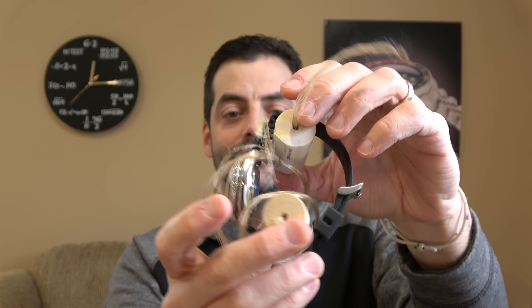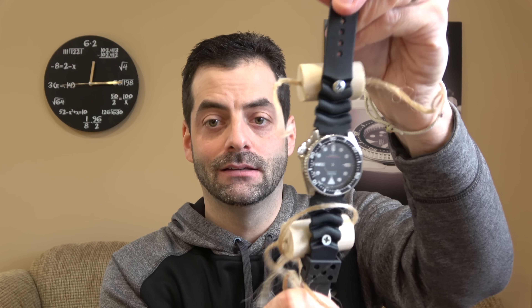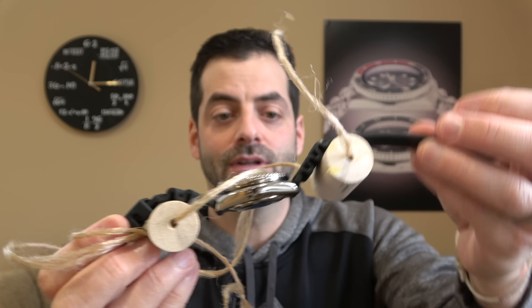But other than that, it's fine. This is the whole apparatus — you can see it now that it's off the jig. For completeness, I'll open it up and show you what it looks like. Still works fine. I did screw the wooden dowels into the straps to prevent them from slipping — it might have affected the results a little bit, but I'm sure if the results were closer to what was needed, the spec of 44, and it came out to be like 45, I would have said maybe the dowels impacted it. But no — we went way over 80 pounds before the knot slipped.